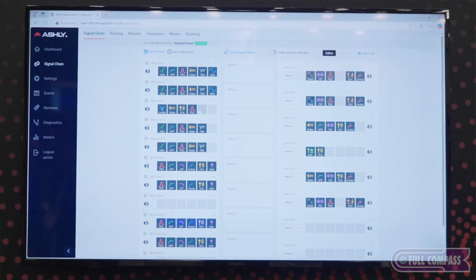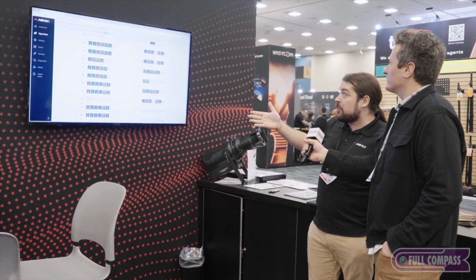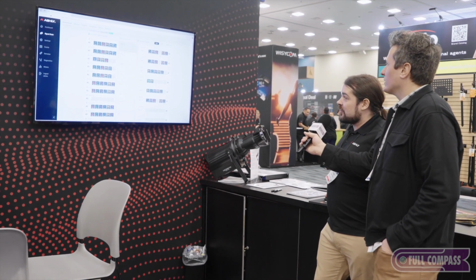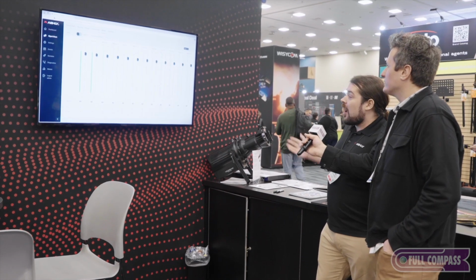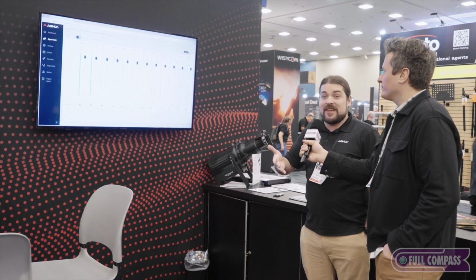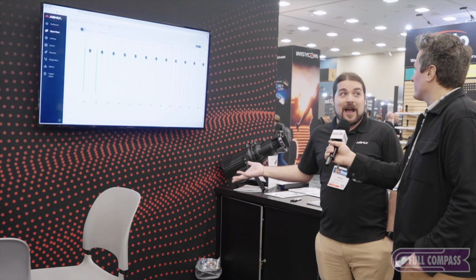This is the main signal chain page. This is where you load all of your DSP functions in, the inputs and the outputs. You can also see in the middle of the screen, you have the mixers. This is where you route your signals and adjust the levels. Once you get a couple of DSP functions loaded in and the outputs and the inputs, route the mixers and turn your level up, you'll have signal flowing from the ins to the outputs.